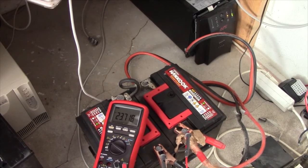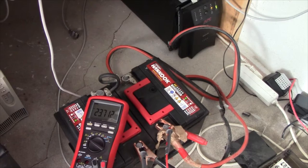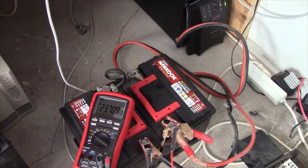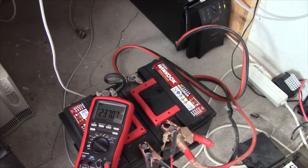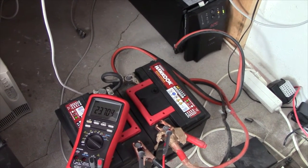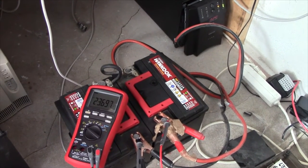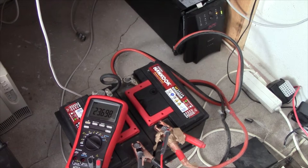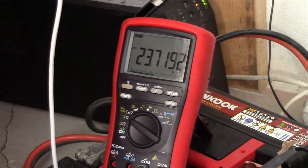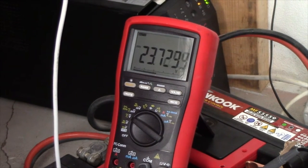Okay, so what I'm gonna start by doing is give them just a couple of cycles at fairly low load in order to essentially wake them up a bit. And I'm gonna give them a good shake to mix the electrolyte up and just try and get a bit of life in them, give them a bit of exercise. And if that doesn't do anything, then I'm gonna try and hook up my desulfator. Oh, there we go. I just gave these batteries a big shake, just shaking them all over the shop in order to mix the electrolyte up, and